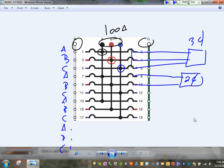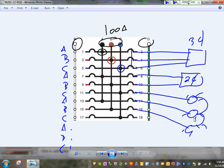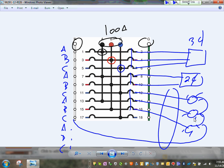Now, if you want a single-phase, if you have multiple lights, these guys are lights, and I want to feed them from a multi-wire branch circuit, this is how you feed them. And since they're all neutral, you bring them all back to the neutral. Can you guys see that? And you tie these together. Here's a three-phase load, how you connect here. Here's a two-phase or two-hot load. And here's a multi-wire branch circuit feeding lights and receptacles, sharing a neutral. Any comments, any questions, guys?